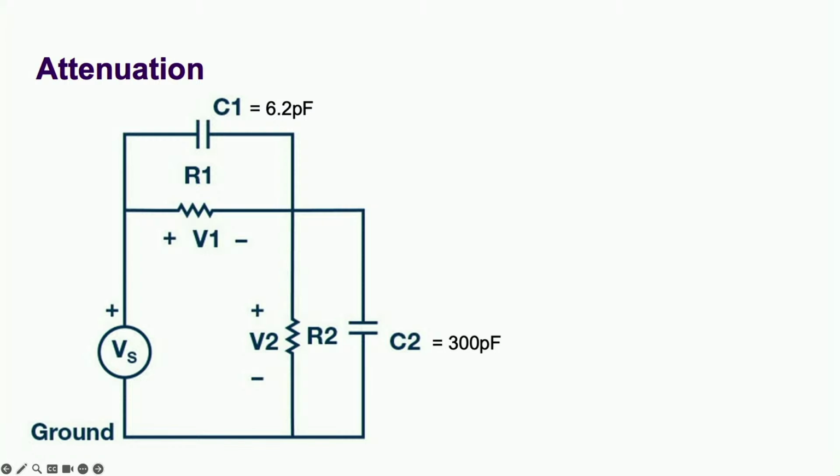So we purposely add capacitance in parallel to drown out the unwanted capacitance. The benefit of this is we can now set the correct divider ratio with these added caps. This is the logic behind the compensated attenuator. But it doesn't stop there. What about the capacitors we just added?